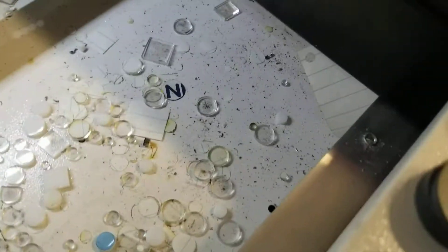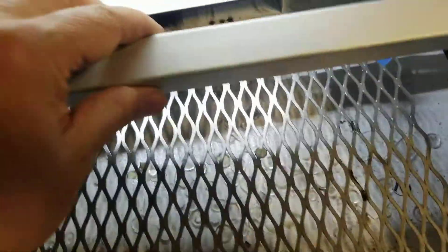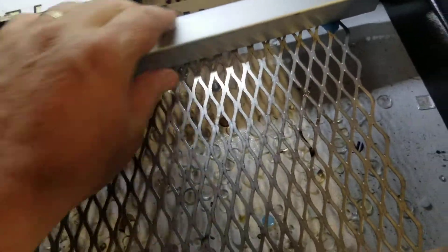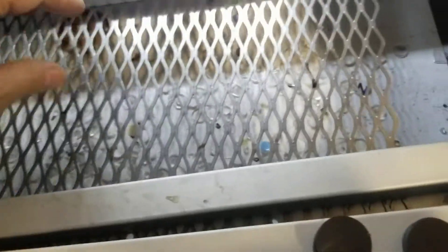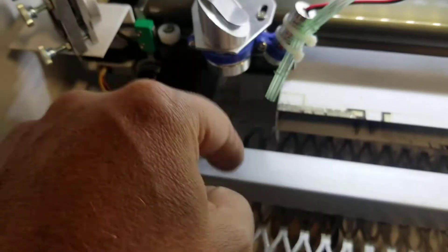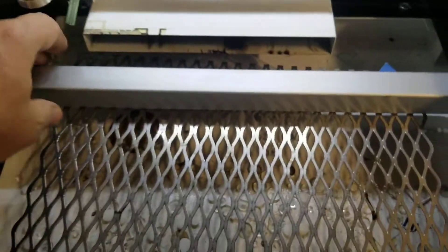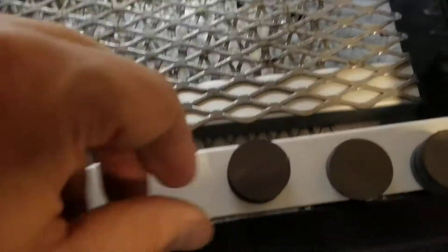By opening this up I'm able to basically fit about an 8 by 11 sheet of acrylic and cut it. It's just a simple L-bracket that goes across the bottom and builds a frame, then I can slide the acrylic in. I put down some small standoffs — about one inch — and that builds a second layer. The reason I do this is there's a focal point on this laser, adjusted down to the finest tip point, and I've found that when I set it up this way and lay the panel down, it is a perfect focal point.